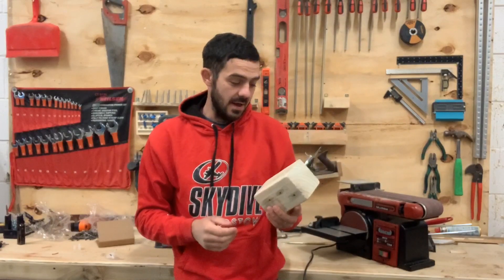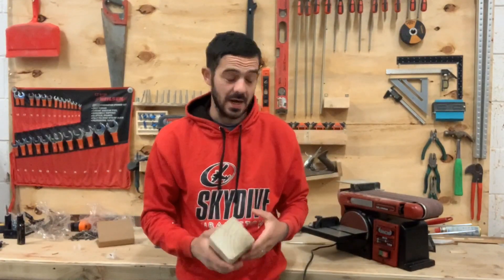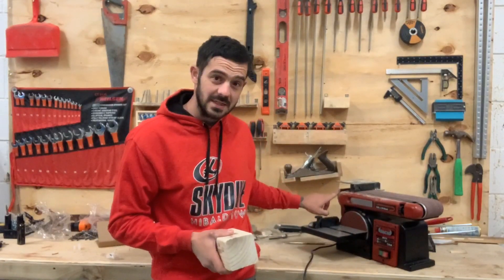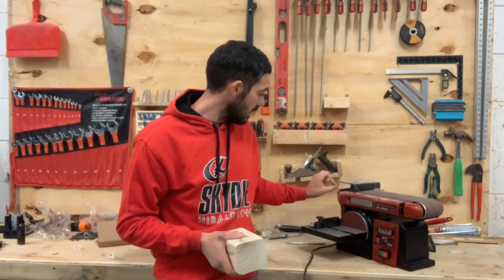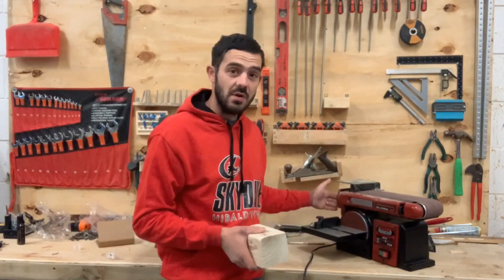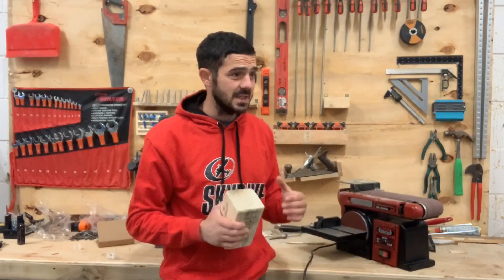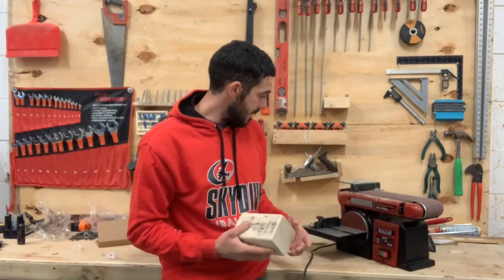That works so much better than the cheap Chinese one. Is it worth £40 more? No — it's worth about £100 more than the cheap Chinese one. The stop is so much more secure and so much safer. Even without the dust extraction turned on, because of the design of the body — the way it shapes around the back — it takes the dust and carries it into where the dust extractor would hook up. So even without a dust extractor connected it's still throwing dust down and making a pile at the back, coming out through the dust port. On the cheap one the dust goes absolutely everywhere.